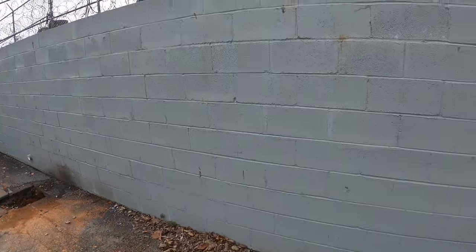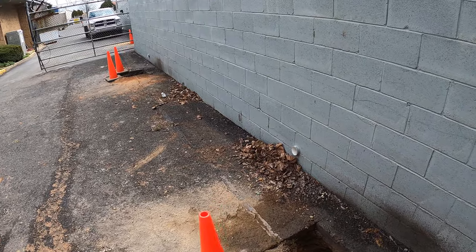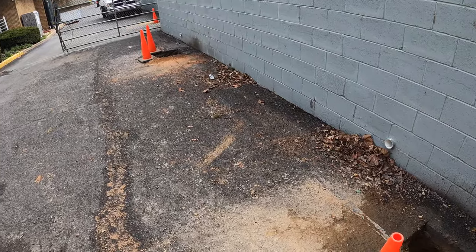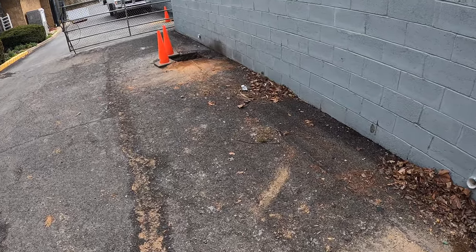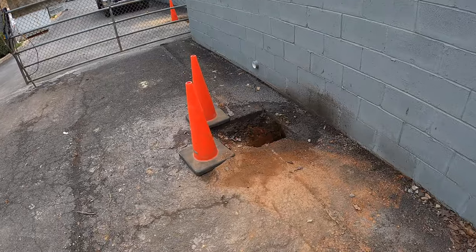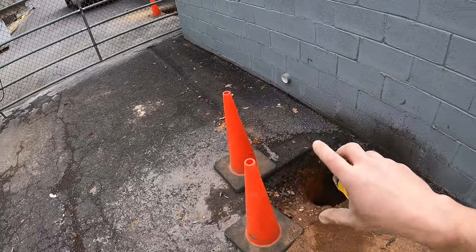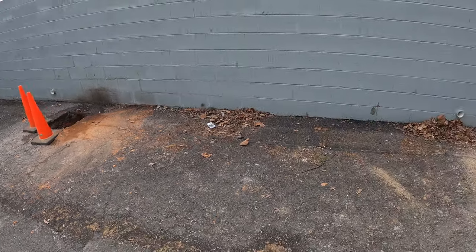It's unfortunate. Honestly, I feel bad for the customer — he spent a lot of money to have this wall built, and the guys who built it didn't follow the plans by the engineer. He found out afterwards that they didn't have it inspected with the township. We have the engineer out here right now documenting and taking measurements to come up with a plan other than just ripping the whole thing down and rebuilding it, because the customer honestly doesn't want to do that. We're talking about maybe digging this whole area up, putting in a new footer — the right size footer — and anchoring it to the wall. But that's all up to the engineers.